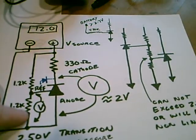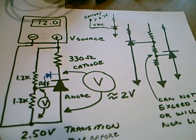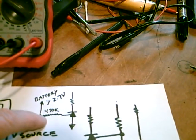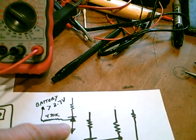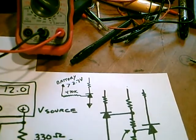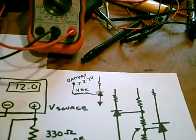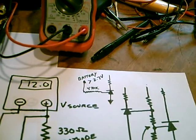So you have to be very careful with your voltage dividers. If you're feeding directly from a battery — say you're measuring a lithium battery and you want to stop when you get below 2.5 volts — you cannot connect directly to the 431. You should go through a very high-value resistor, and that will limit the current, not only protecting the amplified Zener from being destroyed, but from drawing high current continuously and draining your battery.